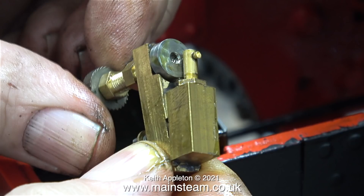Does this remind you of anything? If you tip your head to the right and look at the image on screen, you will see that this mechanism is just like an oscillating cylinder that you would find on a toy steam engine, except it's much smaller and the piston rod is also the piston. As the ratchet is rotated the crankshaft rotates, moving the piston in the cylinder up and down. On the upstroke some steam oil is drawn into the cylinder, and on the downstroke the oil is pumped out via a non-return valve underneath the lubricator.